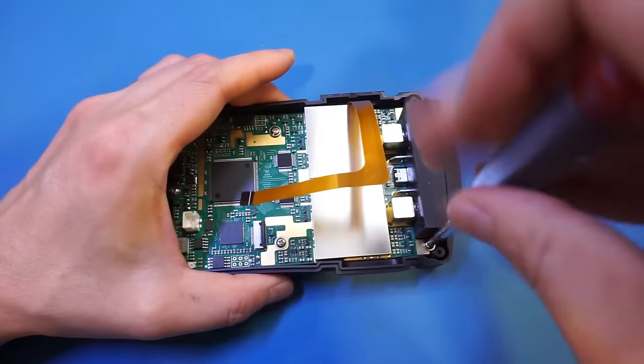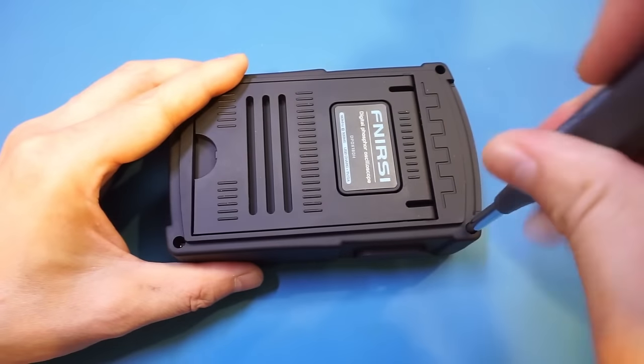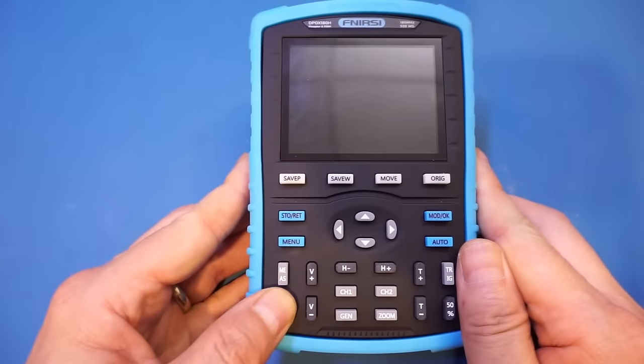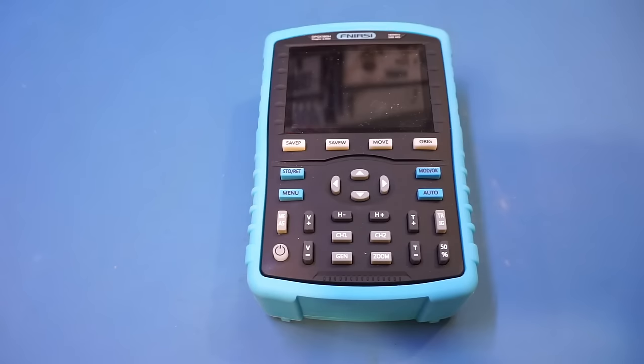All in all, I'm pretty impressed with the capability of this oscilloscope, especially taking its price point into consideration. It met its specified 180 MHz single-channel bandwidth claim, and that by itself is quite impressive. It even comes with two 200 MHz probes, and I don't know how they managed to keep the price this low. The signal acquisition quality is not top-notch by any stretch of imagination, but it's certainly good enough for what you pay for. I can definitely see the competition in the entry-level oscilloscope market getting even more fierce.